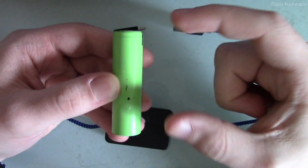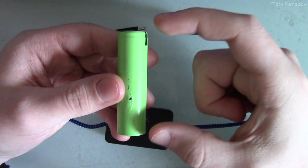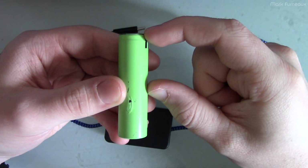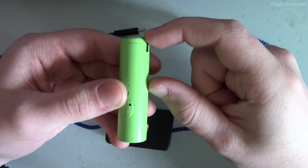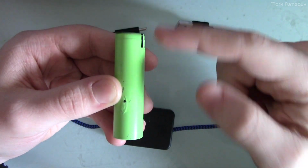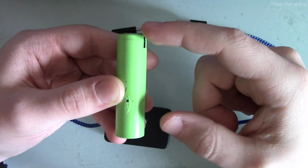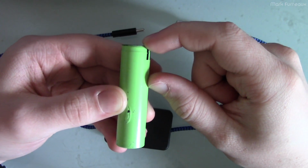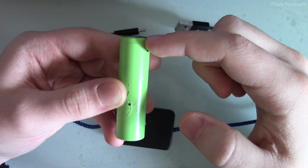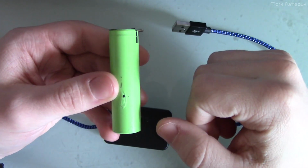I just did it in two cycles. These are just some theoretical numbers here, but let's say that the battery is rated for 400 full discharge cycles, but it may be rated for like 1,200 50% discharge cycles. So, 1,200 is more than 2 times 400. Because of this nonlinear relation, the shallower the depth of discharge you do, the more cycles of that depth you can do. So basically, charging more frequently rather than doing a deep discharge will extend the life of the battery.